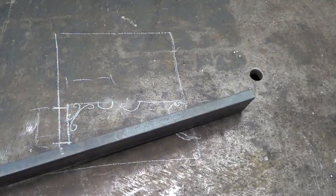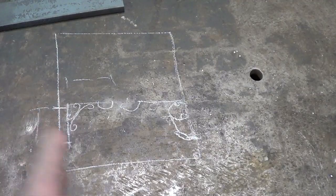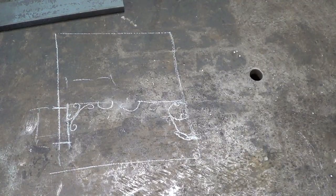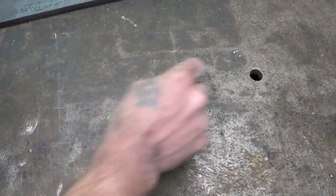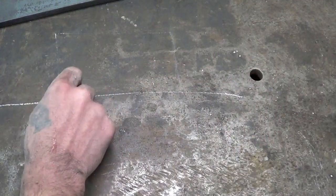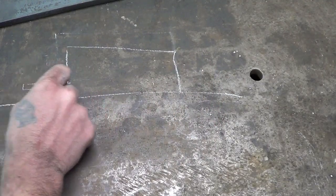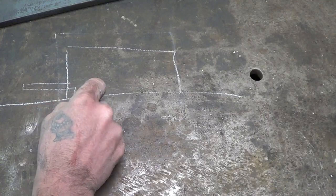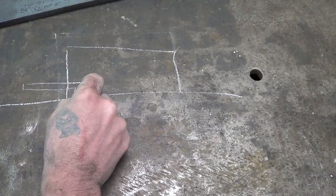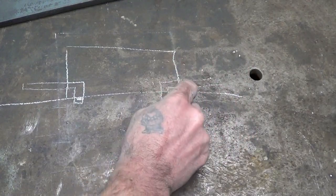What I'm using for the brackets is 1/2 inch by 2. It's pretty hefty. I'm thinking a big fireplace, a big display piece like that, we want a little extra mass to that. The issue that we have, though, is this is the face of the fireplace, and this is the fireplace in here. He's going to mount these brackets into the wall, and what he's asked me to do is give a 4-inch return for the pivots.